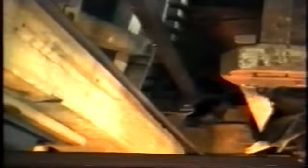Here's some guide rollers for the belt, which came back to drive the wire machine. Nice wooden rollers in the frame. This is the cross for the striking gear, which is resting on the stone floor forward, just above windshaft level, and there is the pinion that engages the brake wheel teeth. The camera's not focusing. It doesn't like that, it can't see properly. Yeah, it's focusing a bit better, and that's the cross shaft, which goes across underneath the wind shaft. Solid belt pulley.